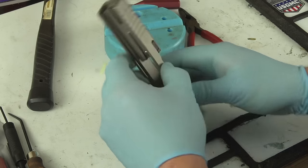And what you want to do is, I normally grab kind of a fat punch or kind of a larger punch of sorts, but you can use, like in this case, this Glock tool right here that also has a 3/16 nut driver for the front sight. You can grab that since it's kind of a larger bearing surface, compress your striker sleeve below flush, and you're just gonna start your back plate into place. The back plate will capture it, then invert it, use the punch, compress the rod that powers your extractor, and push it into place, and it should lock into place.